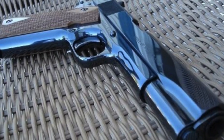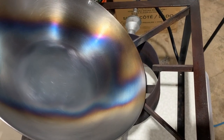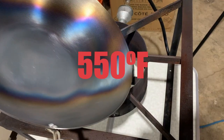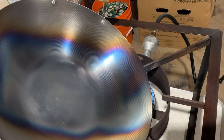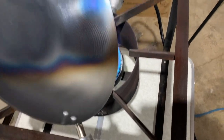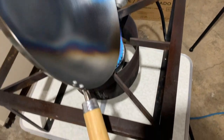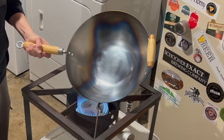What you need to do is blue the steel — heat it to a very high temperature and let the surface oxidize to black iron, also called magnetite. If clean carbon steel is heated to above 550 degrees Fahrenheit, it reacts with oxygen in the air and the surface oxidizes to black iron oxide. This black surface gives the steel a beautiful blue-black to aqua blue patina. This blued steel surface adheres quickly to oils, and when coated with oil it is very rust resistant, non-stick for cooking, and has been used by blacksmiths and Chinese cooks for millennia.